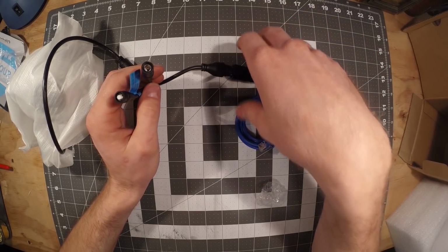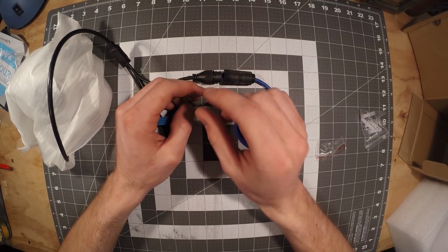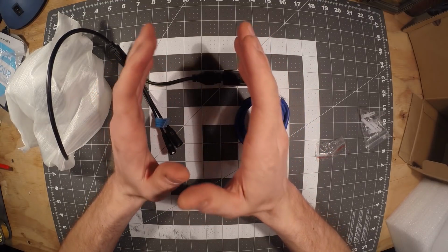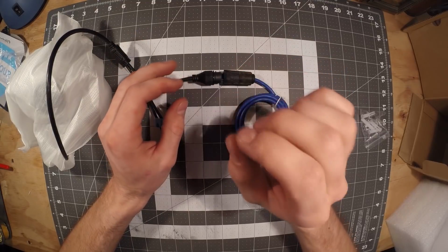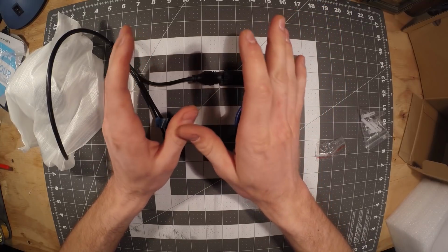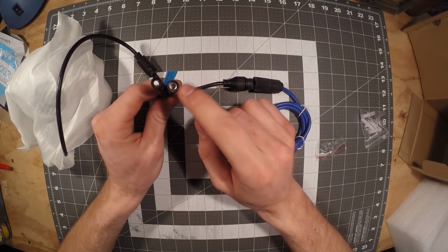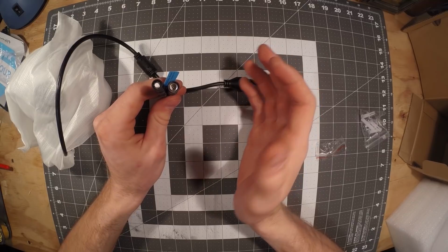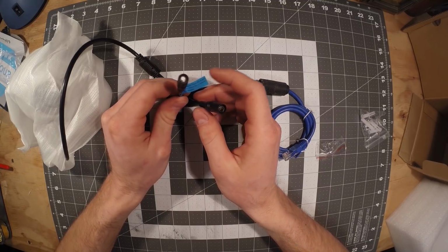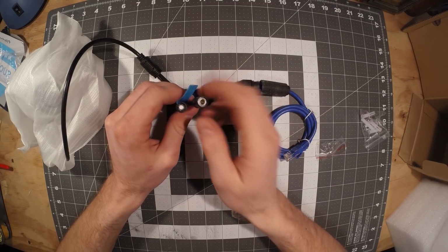Some PoE switches are nice enough that if there's a problem on one port, it'll be isolated and it'll only short out that one port. However, on more inexpensive PoE injector switches, I've actually had instances where if one port shorted out, the whole thing shorted out, so every camera stopped working. And this is a problem with certain devices. So if you're trying to do everything on a budget, and do the installation for yourself or for a customer of yours on a budget, then you could have an instance where a camera gets shorted out and then the whole system goes down.